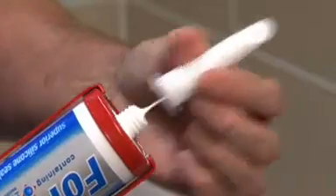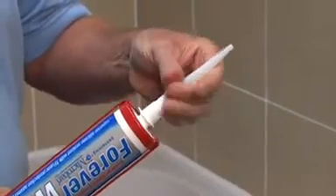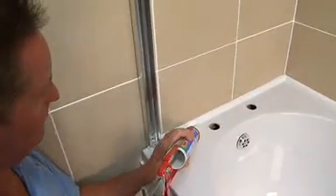If your bath is in an alcove, repeat this process at the other end of the bath. Now take the sealant gun and change the nozzle to the fine one straight away. Apply a small bead of sealant along the top and bottom of the longer profile strip and use the Fugi to remove excess sealant. If an air bubble leaves a gap in the sealant, simply apply a little more sealant and profile with the Fugi. Repeat this process in the corner and along the top and bottom of the shorter profile strip.